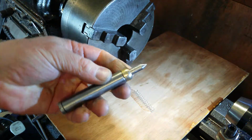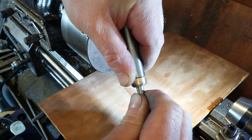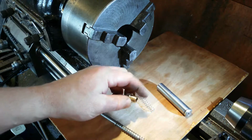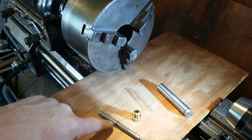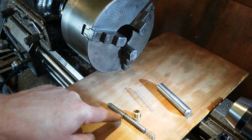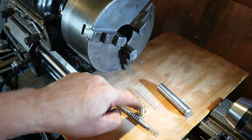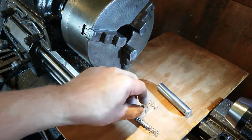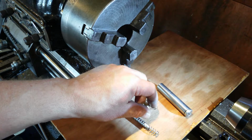So we're all the way in now, and that is bloody tough, but now I've only got about 10mm of movement, so that is not good enough. Right. So I'm going to get the three jaw chuck off, get the collet chuck back in again, take that down to 9.2mm, that spring stop in the centre. Then I'm going to put another collet in, put that back in again, bore that out to 9.3, 9.4mm, 15mm deep inside, leaving lots of threads, and plenty of meat on it. Then I am going to screw it all together